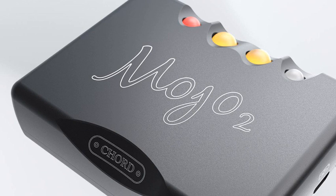So what I wanted to do was to be able to have Mojo 2 run without the battery. The original Mojo required the battery to be there to get the best sound quality because of low impedance and reducing noise that's from the power supply feeding back into the amplifier, and that creates a level of distortion. So I had to do two things. One was to improve the charging power supply, so that when you run without the battery, the charge current was there for dynamic currents. And I had to improve the power supply rejection ratio by putting in separate regulation, so that the effect of the low impedance battery wasn't there anymore, and so you'd be able to run without the low impedance battery. So I actually ended up with much better performance, even with the battery being added.